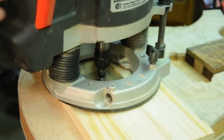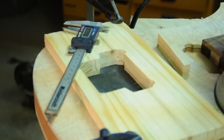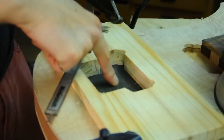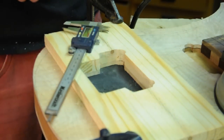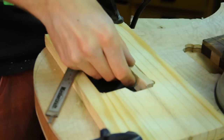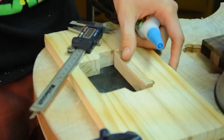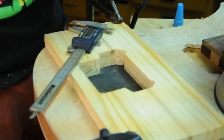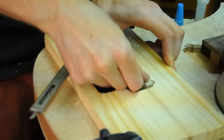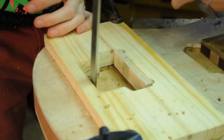I'm ready to route. Now I've reached the desired depth for the front of the bridge cavity. I'm going to add a spacer block here and continue routing from here back to the second depth, using a couple dabs of super glue to hold it in place. That should be it for the bridge route.